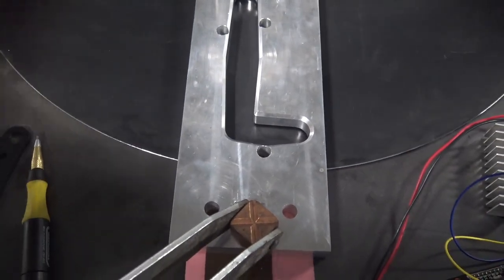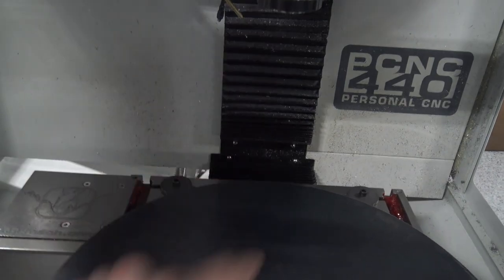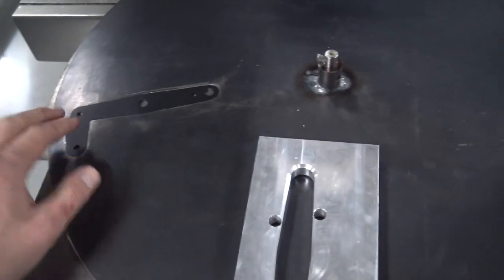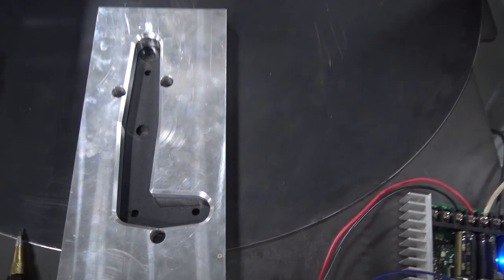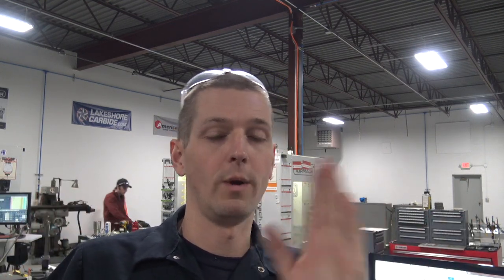The reason I wanted this to be a tight fit is that it helps hold it in place when it locks down. I've got an idea of mounting something on the spindle nose that'll also help hold it. The less slop, the better. If you look and analyze what happens when it usually falls down, it usually tips left — see that? It tipped backward. It's not really a huge deal, because I can have it slow down just when I'm picking up the piece and then speed back up. That's actually a win. That would mean I really want some sort of positional awareness of where the motor is, so I can slow down only in that zone.